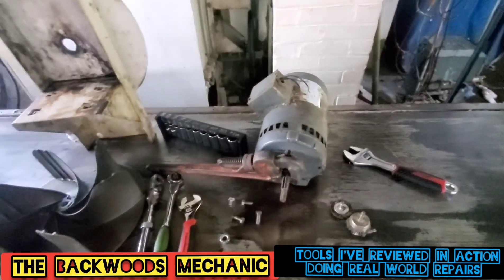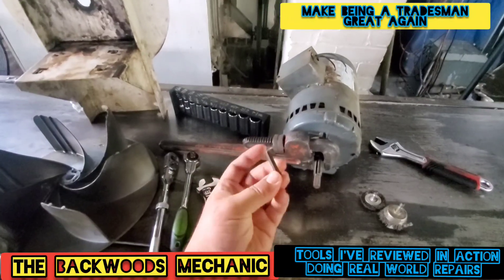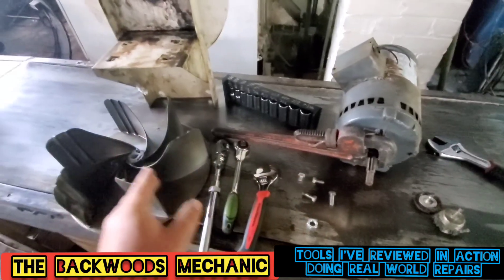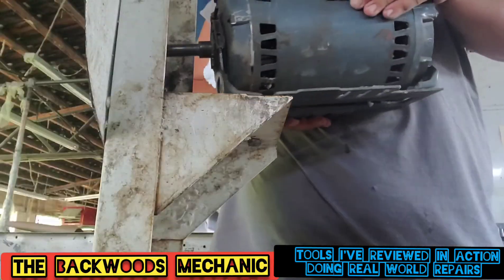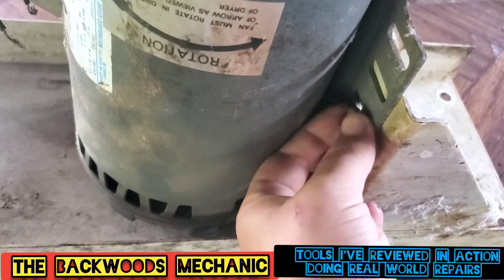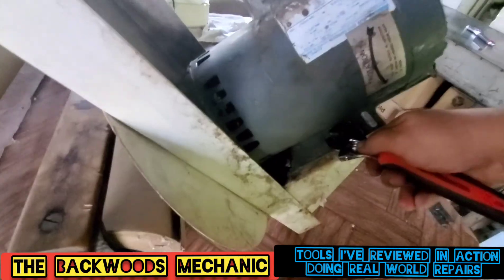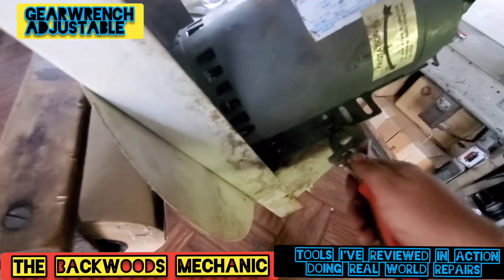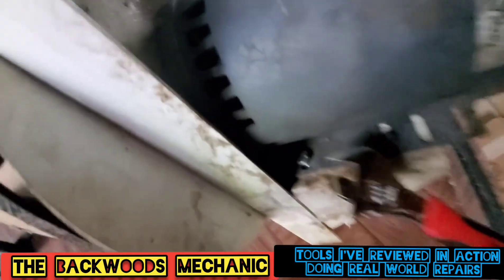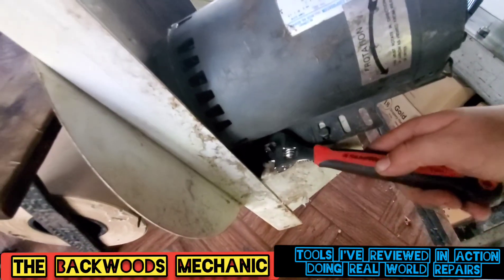So we finally got an extra motor here that I pulled off of another dryer. I'm going to take this — we got a new key for it, some new bolts for it. Ordered a new fastener to put on the fan blade. We're going to get all these put together and see if we get it working. Now we get all these little fasteners in place, get everything good and adjusted, got the center air shaft lined up, and of course we'll tighten everything down on all sides.